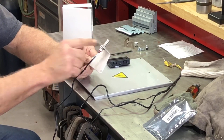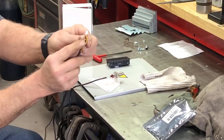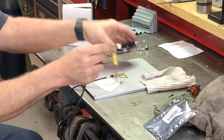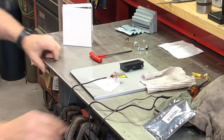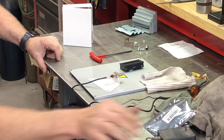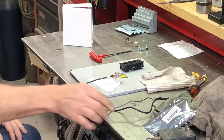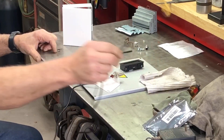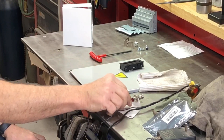And so, this is a sensor, and it comes with a little electric plug — this white one right here that plugs in the back. You have to supply it with 12 to 18 volts. I never throw these power supplies away. This is some energizer from an old charger or something. I just soldered them all in, made a little connector. I was trying to figure out how to mount it on there where I could have a nice display on the lathe.